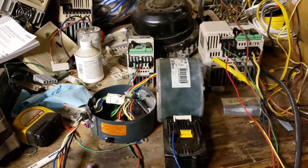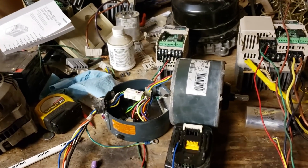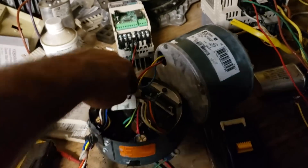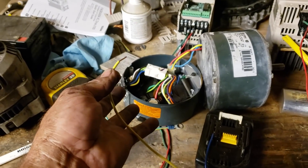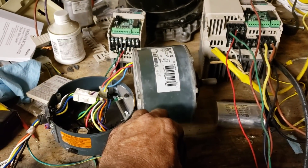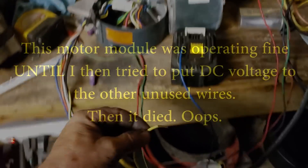We're out in my garage, and yes, this table is a mess. I have a stack of motors and VFDs and stuff that I tinker with from time to time — none of it's been put away. Now, using the same space, I have that ECM module and a spare motor which is the same rating — a third-horse ECM motor. I've just plugged it in here. I'm sure this took 24 volts AC switched through a relay. Electronics don't run on AC — it's just going to be rectifying to DC anyway, so I'm sure I can just hook this up to a battery. And sure enough, this is a Makita drill battery — just going to give it a signal to make it run. And there it goes, it's running. It's hunting because it doesn't have a fan blade on it. Put a load on it — pissing it off.